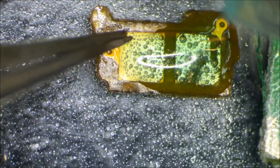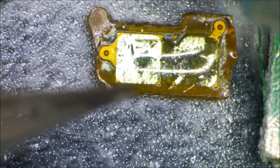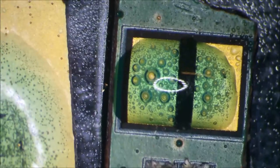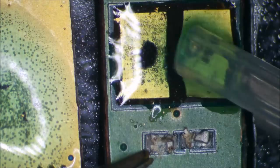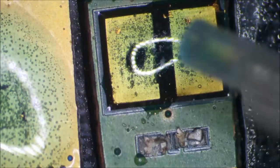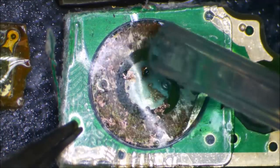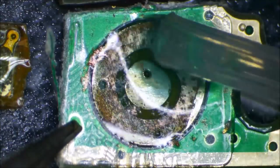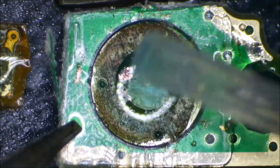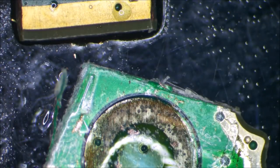The next sample is also going to be very similar - and yes, quite fine bits of gold. Moving on to the SageM keypad phone main board - expecting ENIG, and yes, it comes off as a fine powder with little gold flakes floating around in the acid. Now this is the interesting part - the actual keypad from that phone which was a separate board with some kind of different treatment. As you can see there's not much there - very little gold in it. I suspect the bits floating are probably gold but there's really nothing there.